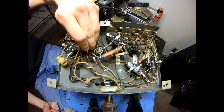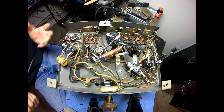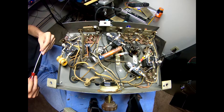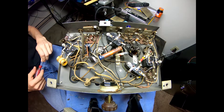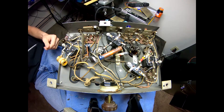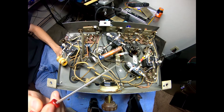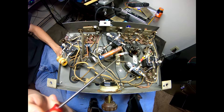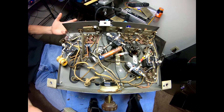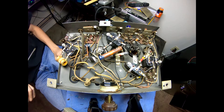For this bit, what I'm going to be doing is replacing all of the resistors. Now, you don't normally replace all the resistors in a radio — later ones, quality is a lot better. The later carbon composition resistors tend to hold up a little bit better and I haven't had to replace nearly as many. However, with these older dog bone styles, especially in the Philco sets, just about every one is out of tolerance. This white resistor right here is the only one that does not read out of tolerance — it's a 9,000 ohm resistor and it just barely reads 10k, so that's pretty good.